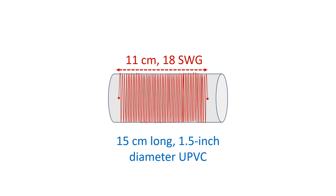It is basically an upgrade of a 20 meter antenna. You need two pieces of insulated copper wire of 5 meters each from the feed point to the loading coils on either side. Beyond the loading coils, we need another 2 meters each of insulated copper wire to make the antenna tuned for 80 meter. It has been suggested to first tune the 20 meter part of the antenna for 1:1 SWR and then tune the extra 80 meter part.